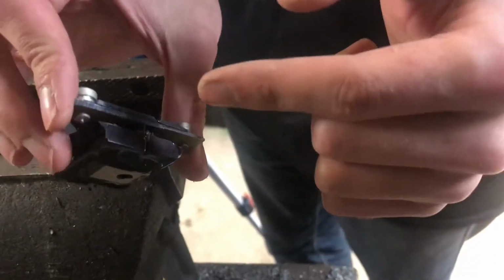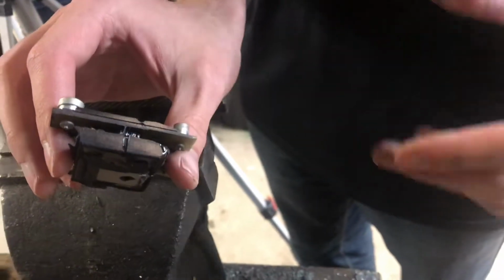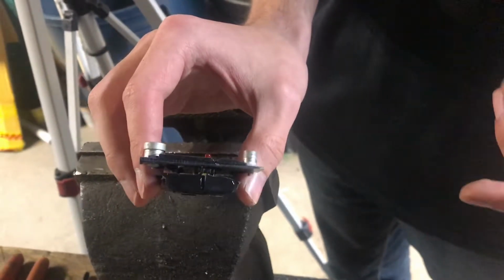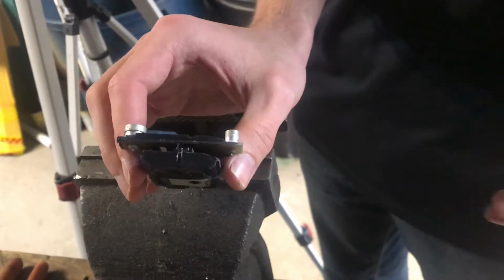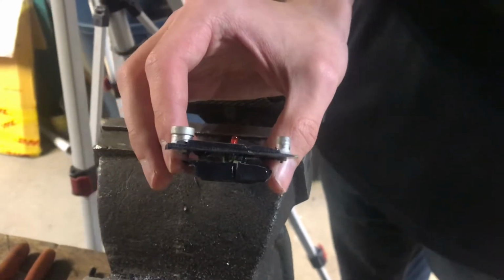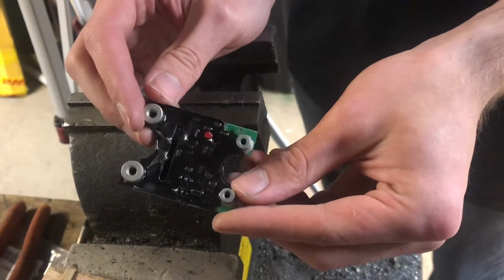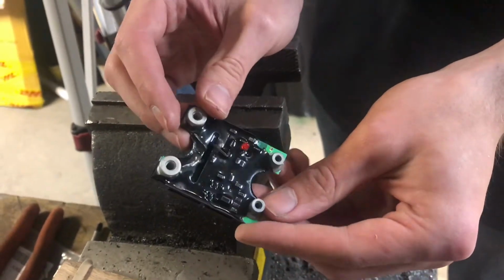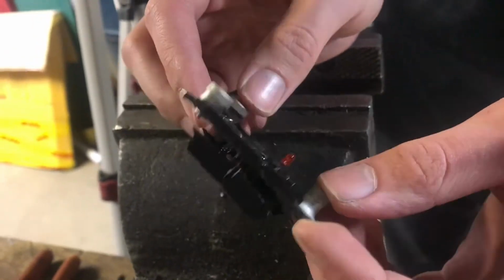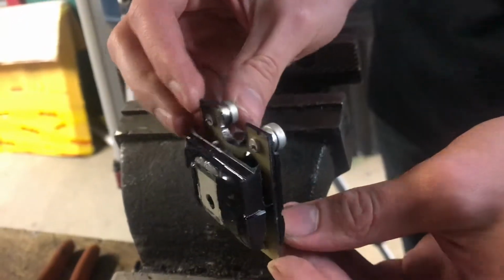I think they're doing it with a transformer, which is a little different. Again, there are no electrical wires running from the primary side of the transformer to the secondary. Instead, a magnetic field transfers energy through the iron core. So it's a little bit different principle, but you'll notice there aren't any complex integrated circuits on this, at least not that I can see. The most complicated devices on here are probably the transistor and the transformer.